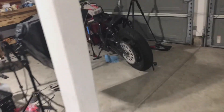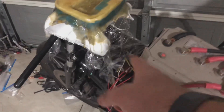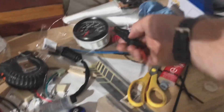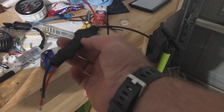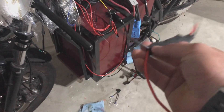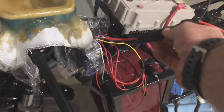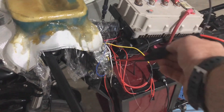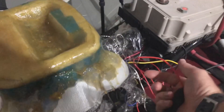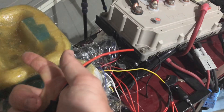I was mostly focusing on getting the switch hooked up and getting that little display there. I also put together a 12-volt to 5-volt DC converter — I pulled apart an old Bluetooth transmitter that plugs into a cigarette lighter and desoldered a couple of components. So this input is 12 volts and it outputs 5 volts. I labeled those on there — you can barely see the Sharpie. This will be connected at the original DC to DC converter, which will then power the display, with the wire running up the frame and plugging into the GPS unit right there.